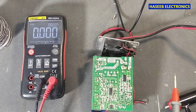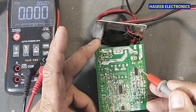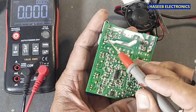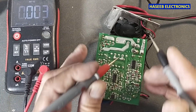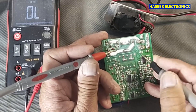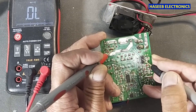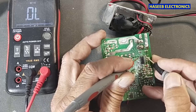In the first step we will locate where the driver section is. If we see this IC, it has two pins here and these two lines are coming from inside the PCB, reaching here at these two points. The output is from TL494 pin number 9 — pin 9 is reaching here, and this is pin 10. Pins 9 and 10 are reaching here at these two points, so the drive signal is reaching there. Now we want to check the drive signal.